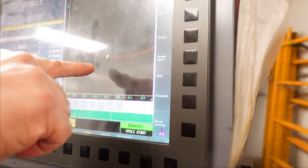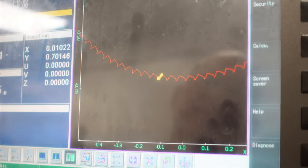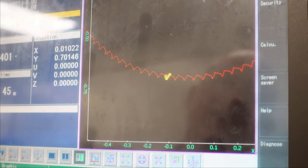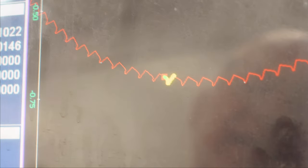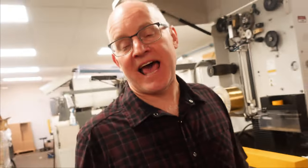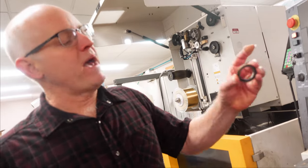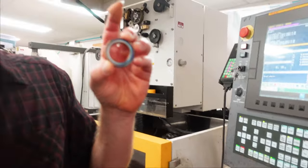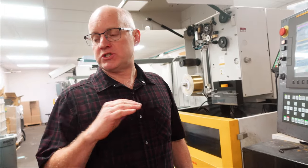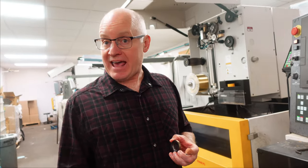Let's watch this in real time. It takes about 26 seconds to do one tooth, and there are 115 teeth on the ring. So basically to finish a ring it takes about 45 minutes, which is a really special process that allows the teeth to be as strong and as accurate as they possibly can be. And that's what allows us to get that really, really fast drive mechanism.